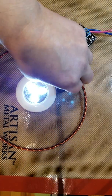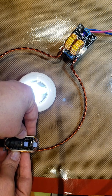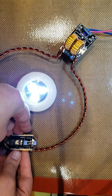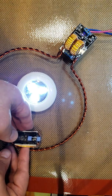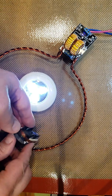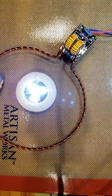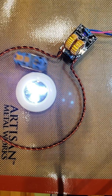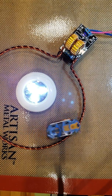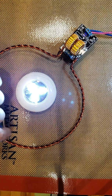Now, what's inside the robot? He's still vibrating in my hand. It's just two tuning capacitors. What's different about this one is to tune this circuit, I did the parallel LC tank, tuned it, and then went ahead and put a Schottky diode in series to bring power into the motor. That's just because this is a permanent magnet DC motor — it expects DC. So Schottky diode, halfway rectified — it would be a lot more powerful, but that's way too much power for this tiny little thing.